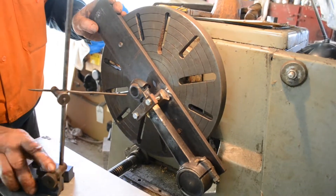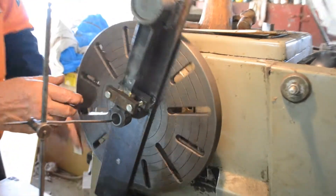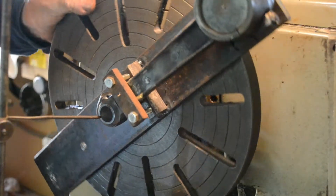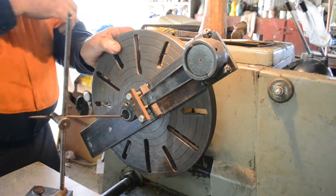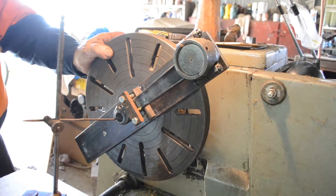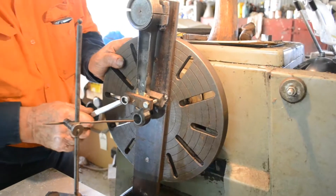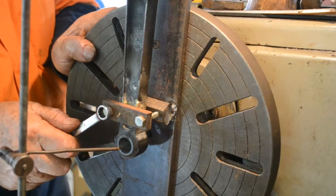Then we get our surface gauge here and we can very carefully put it on there, on the sides there, get that running through there, both sides. We've got a little leeway - if you need to tap it this way or that way, there's probably a quarter of a millimetre space in the bolt hole there that'll move it one way or the other. Just use a block of wood and tap it whichever way you like. Lock it up here, looking at where it's hitting on the web there, locking that side up.